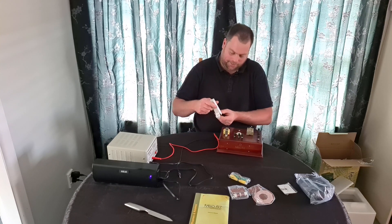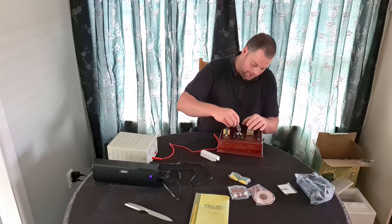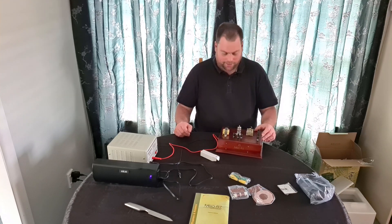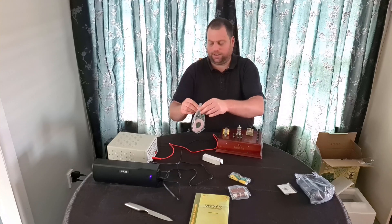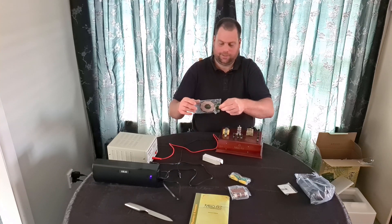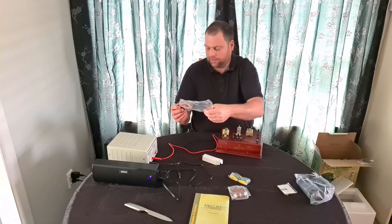As I mentioned before, I'm very pleased with these 12AU7 Chinese production valves in radio circuits. I've had a lot of success with low-voltage radios with these and they give no trouble at all. In saying that, my ears aren't good enough to distinguish the results in an audio frequency circuit, so I couldn't comment on audio amplifier applications — only in basic radio receivers. I know Christchurch, where I live, has very strong signals in the AM band, so I'm going to put in the AM coil and connect that.